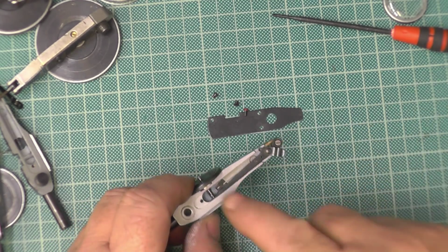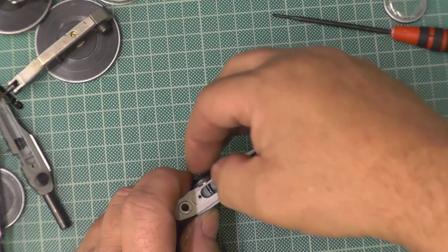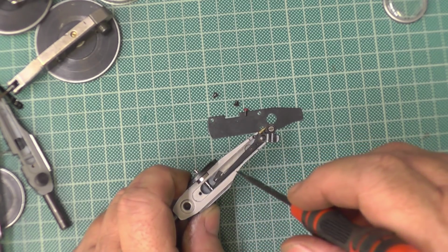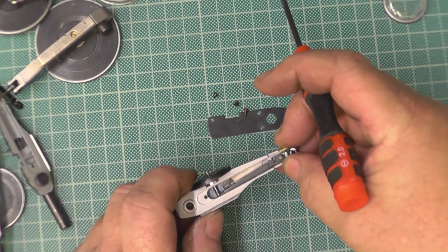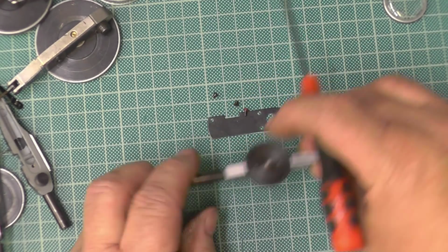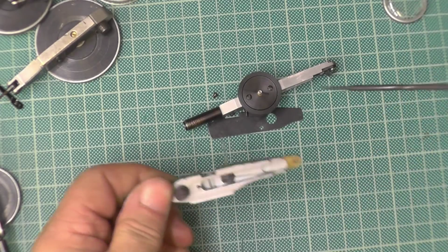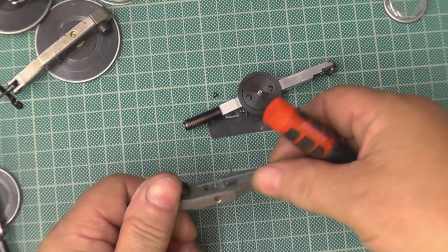Then put the arm and that back on, which is this, all this governs here. Then work the lever with the stylus involved and see how the needle responds. Once you're running ahead, you need to put this back in to lock it onto the spiral. Then once it's locked onto the spiral, you can take the Blu Tack off and put the stylus back on, and work it to see how well it responds to being moved backwards and forwards with the lever, which is this fella here. And you might have to take the hand off and wind the handle down half a turn or add half a turn till you get the stylus responding in correspondence with the dial evenly, not one end heavier than the other end, as I call it.